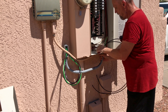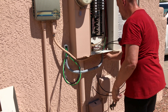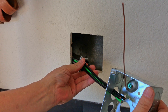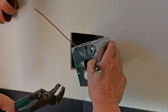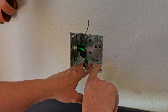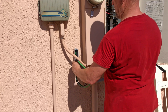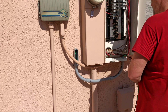I'll get my lock ring on here. Now I'm going to have multiple knockouts out of this box because I used it for another job and did two knockouts here. I don't know if that's a code violation but I have a feeling you guys will let me know. If it's a safety issue I'll definitely go buy another box and switch this one out. I need to push it back a half inch and then secure it to the stud. Overall it looks pretty good. I want to go outside, pull all those wires through, pull the slack out, put the cap on the LB, and then when it cools down in the morning I'll wire in the breaker.